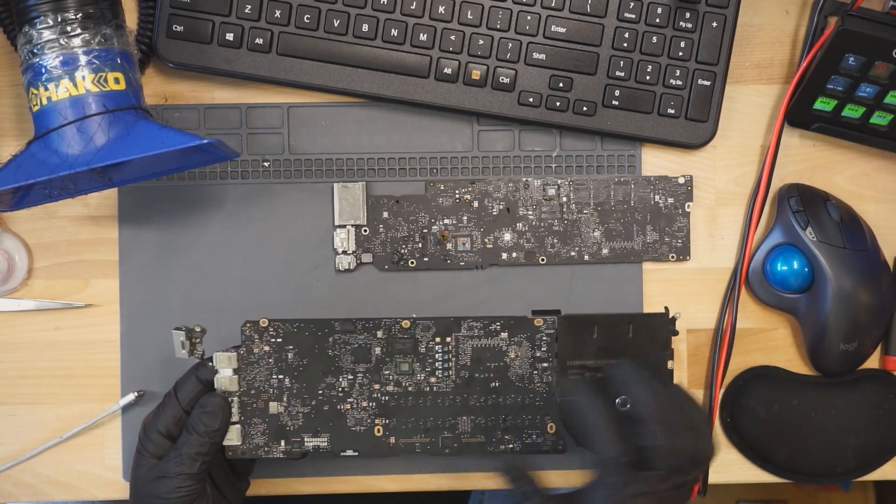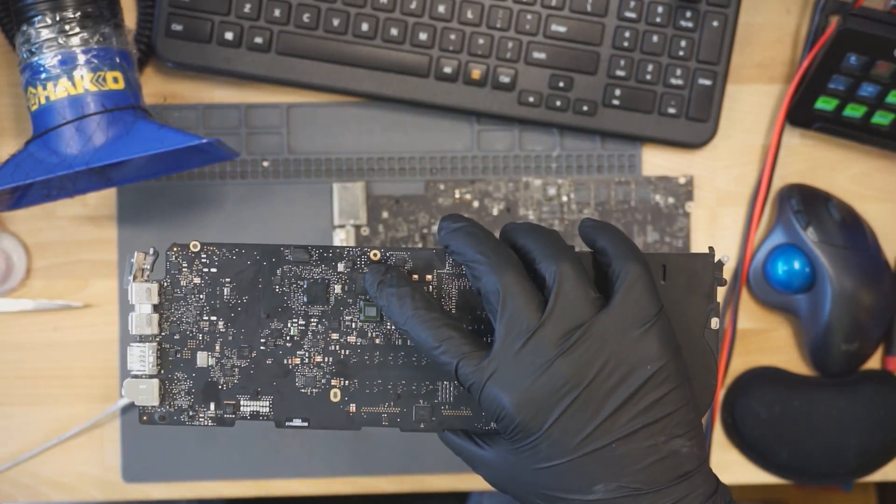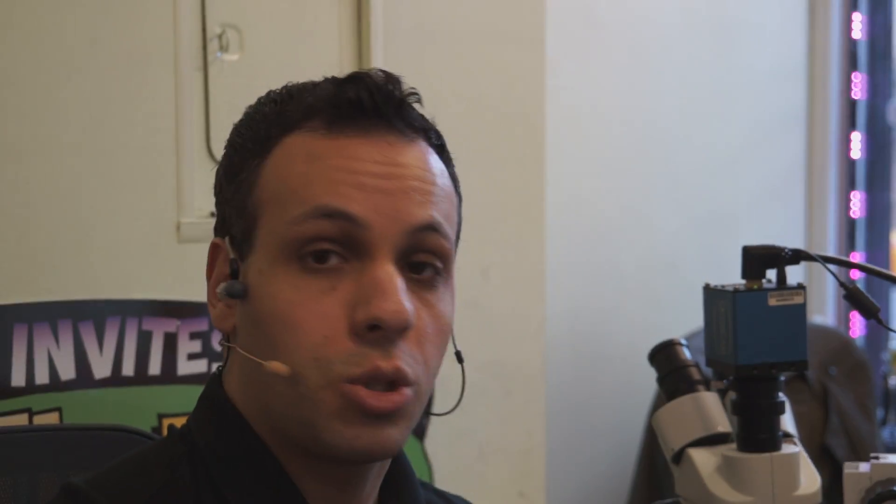This board was having an issue where it was missing PMSleepS4L. We did a physical inspection of the board and there was a mess right around this area. I'm going to assume that whatever happened — whether liquid or any sort of junk — may have affected things in the surrounding area that are sensitive. Like a chip whose sole job is to create a 32kHz and manage a 25MHz clock crystal. Even the tiniest bit of water is going to hurt it — it's not like an ISL 6259 where you'd see a hole punched through it.